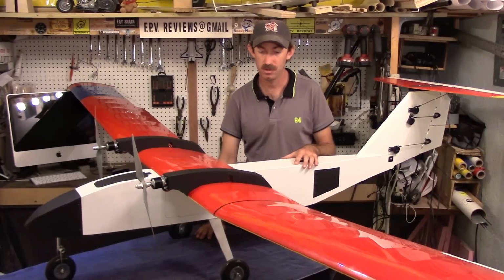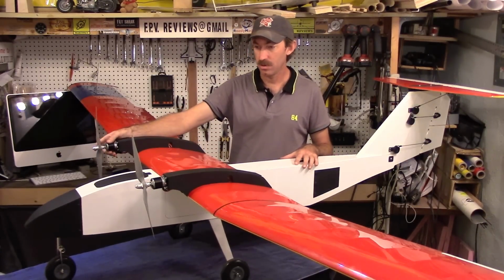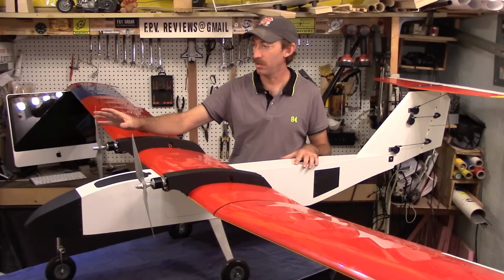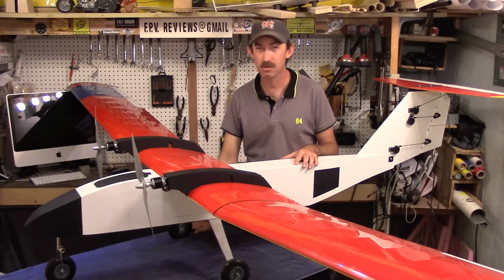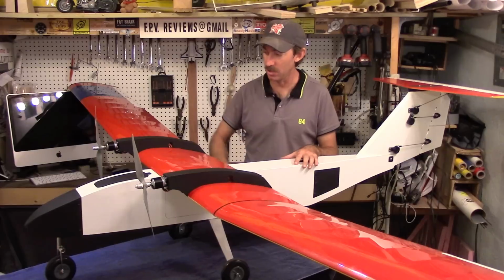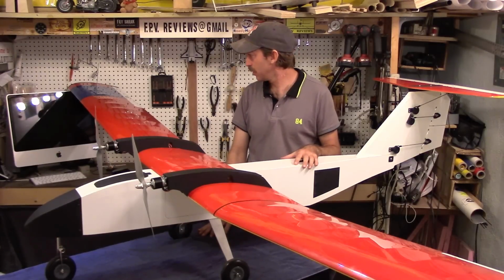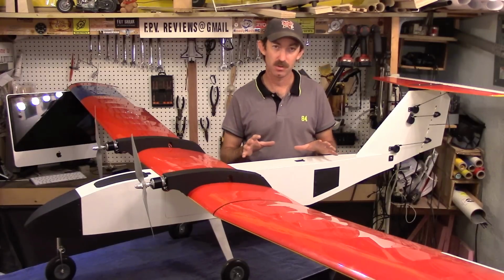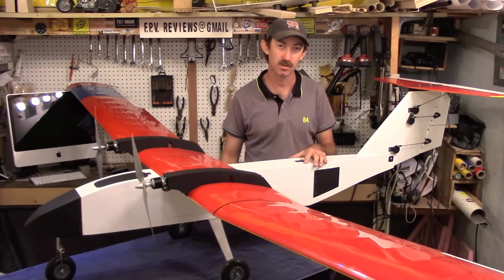So the motors on this are the stock motors, and the propellers are the stock propellers. They're 13x8, and the motors are E-Flight Power 15 950 kV motors. So they're completely stock. They're also using the stock 50 amp ESCs that we recommend. So also, let's get into it a little bit deeper and take a more detailed look, closer up, at some of these modifications.